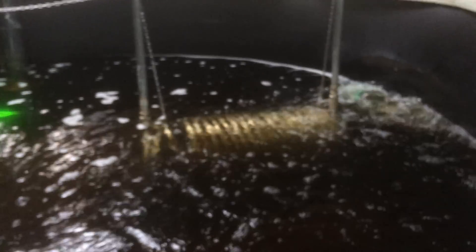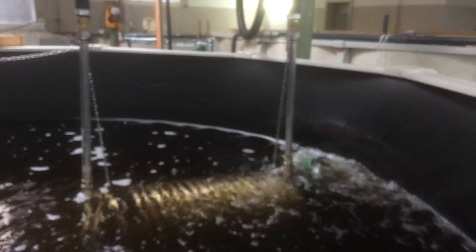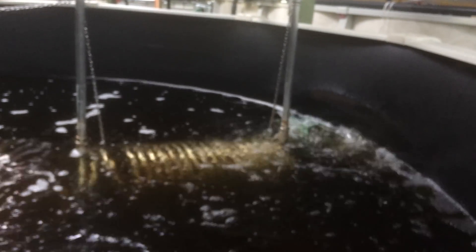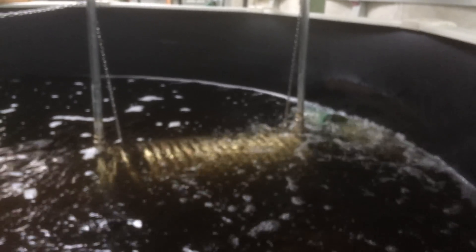I'll keep you updated, but my time is almost up. On the heating system: we get our heat from the sawmill. The sawmill creates electricity for several communities around us, and generating electricity creates a lot of heat. This excess heat is used to heat our whole community and surrounding communities, and they still have excess heat throughout the whole year, even in summer. They use water to cool down their electrical plant, and this warm water we then use - slightly cooler than what they give us. They supply it at about 80 to 90 degrees Celsius; we reduce that to 50 degrees, which reduces calcium build-up in all our pipes.